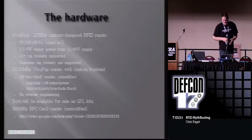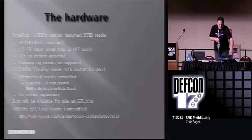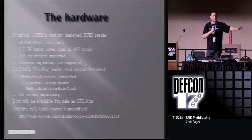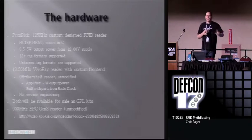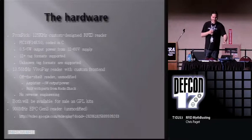Let me introduce you to the hardware first. This is a custom-built 125 kilohertz RFID reader based around a PIC 18, written in C. It'll output anywhere from about half a watt with the 12 volt supply I've got on it at the moment, scaling up to about 5 watts output power with a 60 volt rail. A typical off-the-shelf 125 kilohertz reader outputs somewhere between 10 milliwatts and 50 milliwatts — we're dumping a lot of power into this coil. It's capable of reading, copying, and playing back over a dozen different tag formats at 125 kilohertz, including tags we have never before seen.